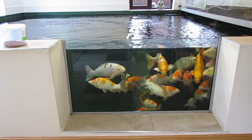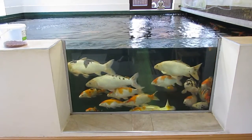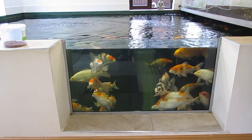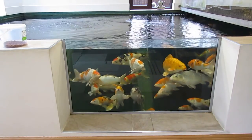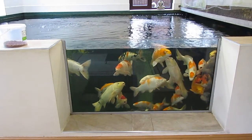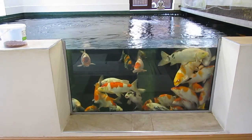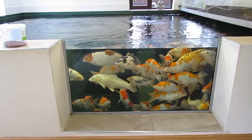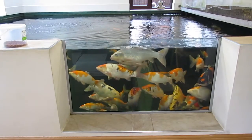Whereas if it was an outside pond and it got to say -12 or whatever it is, and the air source heat pump stopped working, the koi pond would be exposed to -12 degrees, lose its temperature quite rapidly, and you'd probably find all your fish dead in the morning. So it is necessary to have an inline electric heater, a normal fail-safe one, after your air source heat pump. Then if it did turn off or something went wrong, because anything could happen, you've still got a backup, because your fish will die really quickly if the temperature drops like that.